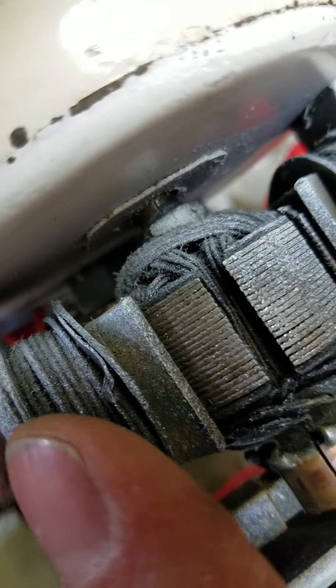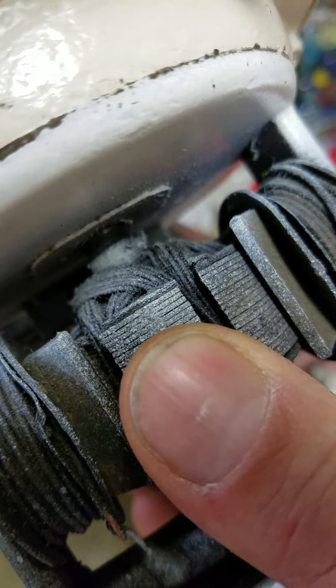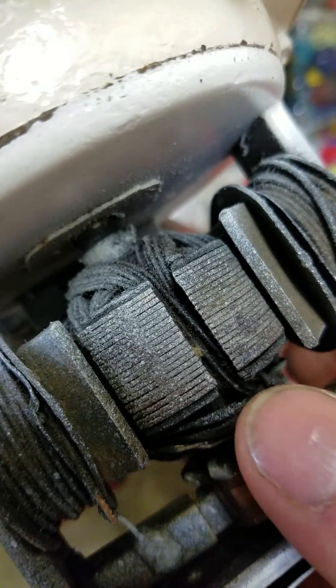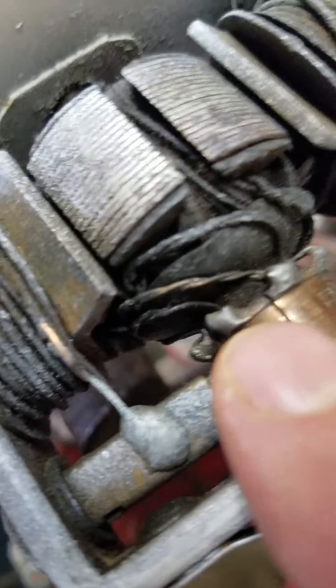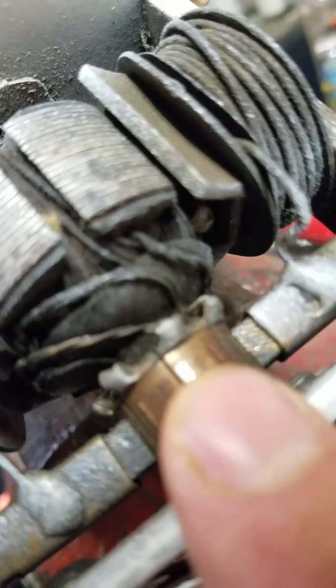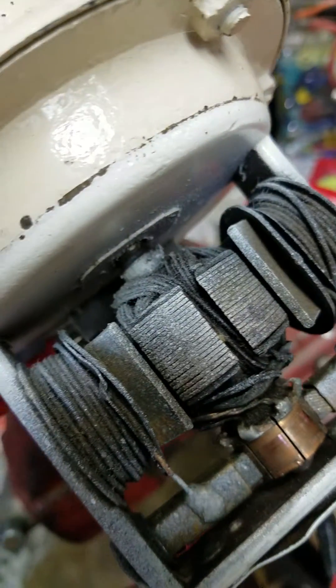Basically, this magnet right here hates that magnet right there just enough, and then just as soon as it gets out of full hatred, you're switching the direction, switching the coil, which is activated by the commutator — you can see that connection right here. The windings are all angled relative to one another such that every time the current changes direction, we maximize that torque again, getting a 90-degree angle between the field and the changing coil inside of it. This is just a super cool motor to look at, and connected to a little bit of siren history, it's also fun.